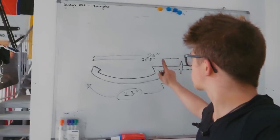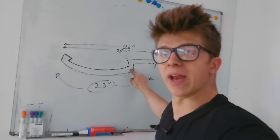And this is why I'm really nervous. This needs an extreme bend here and an extreme bend here. And I'm gonna do it now while that is about 2 to 3 times as thick as the finished thing will be. Because I am indeed petrified that I'm going to tear open the welds, and I wanna make the bends while it's thick because I think it's gonna be stronger and be able to handle this extreme bend.